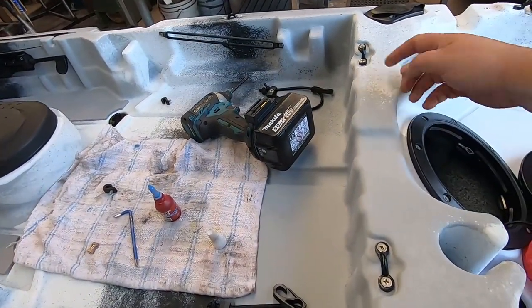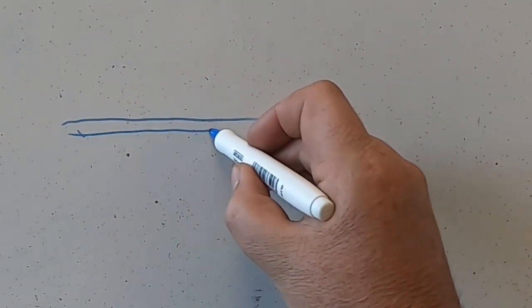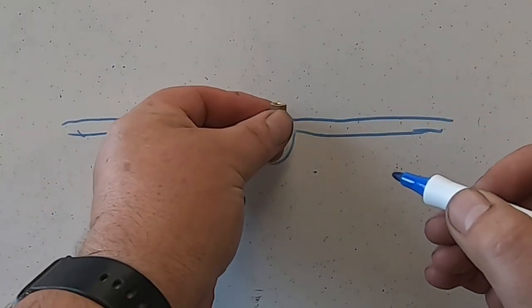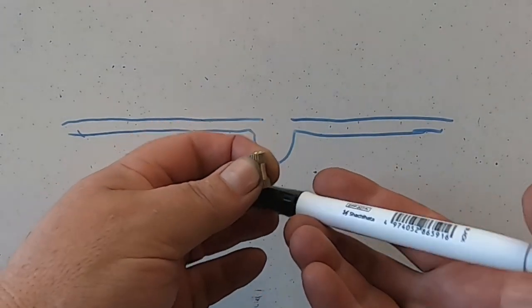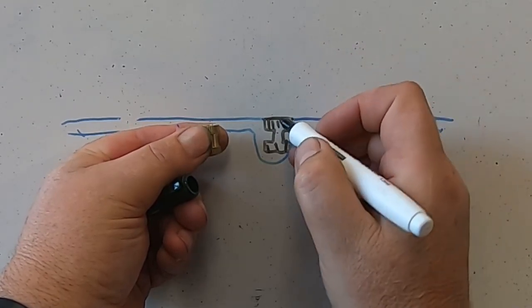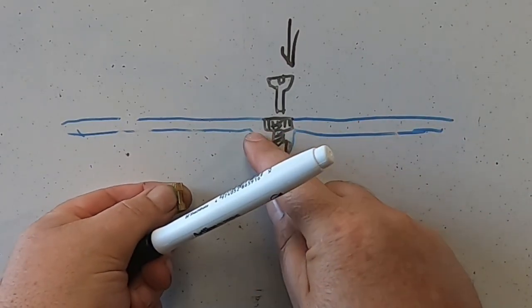Even these ones here, I can put my hand up there and you'll feel there's just a big chunk of plastic. So, to explain that a little bit, you've got your hole there, and underneath the hole there's a big knob of molded plastic, and these inserts, these nuts, go into these settings. So this little brass insert goes into the setting like that, basically like a little bolt, and this has all got thread inside, and then you put your bolt into that. So this bit of plastic is missing.